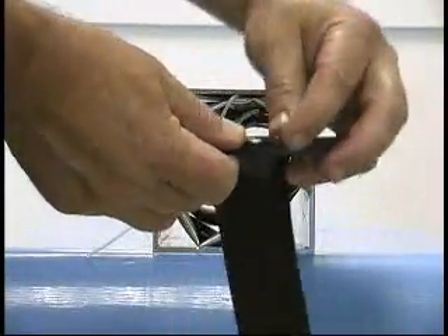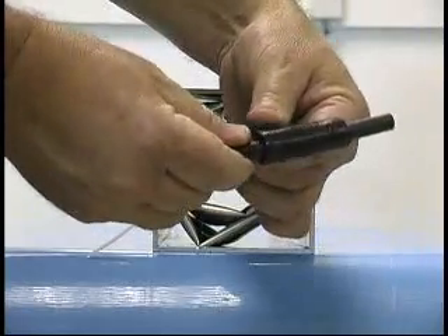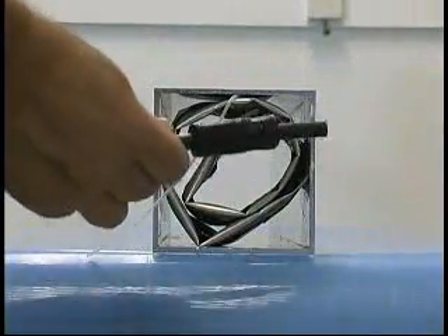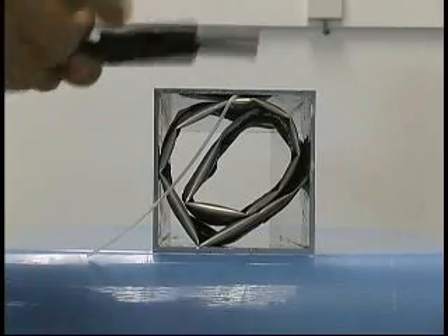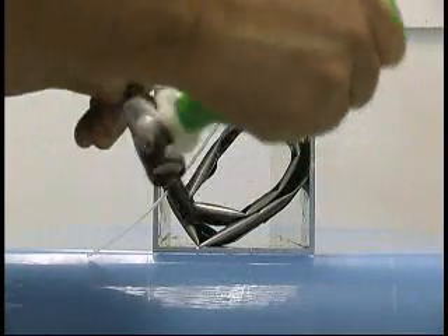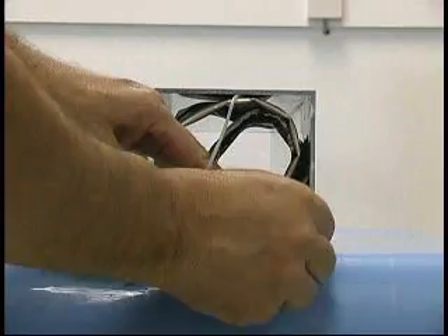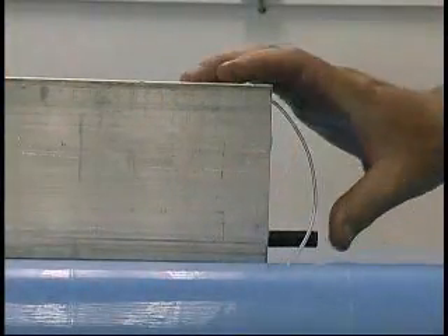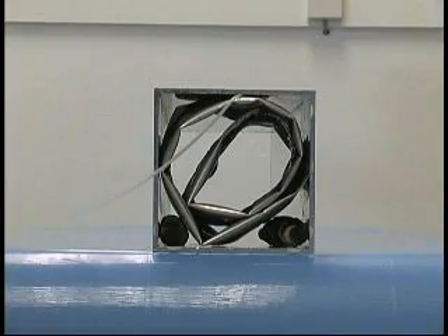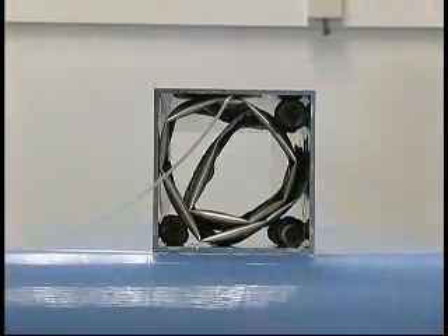Repeat to create four mastic corner pieces. Thoroughly soak two mastic corner pieces and slide them into the bottom two corners of the duct, flush with the outside edge. Allow those mastic corners to rest on the T-Ducks. Thoroughly soak the two remaining mastic corner pieces and place them into the top corners flush with the outside edge of the duct, and allow those mastic corners to rest on the T-Ducks as well.